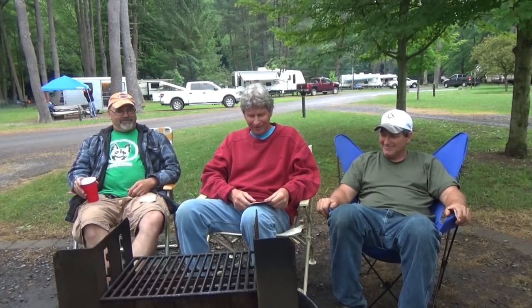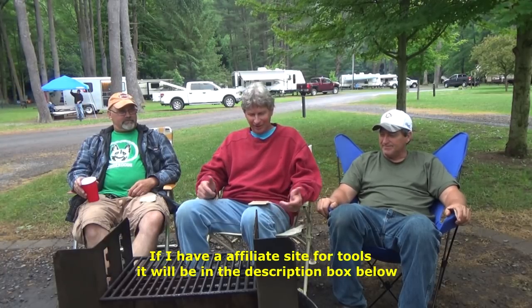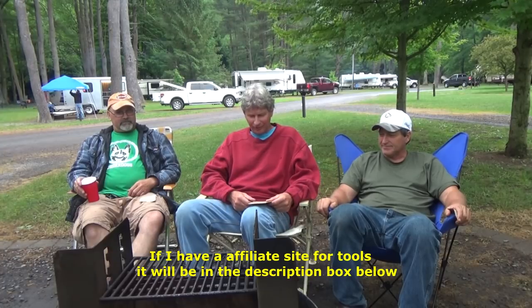All right. If possible. So when I do the blocks and the block sink, I throw some Portland in, and then I fill the webs. I use that Durowall. You've seen that in other videos. I'm always measuring. I always have someone, like my brother, hold the dummy end, and I hold the smart end. Then he holds the smart end, and I hold the dummy end, and we make sure we're right. I always keep measuring. What kind of trowel? You use anything you want, right? Yeah, Marshalltown trowel. Yeah, he uses anything he wants.